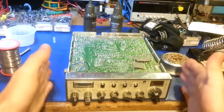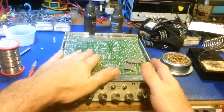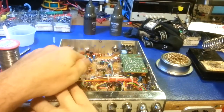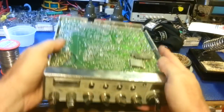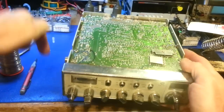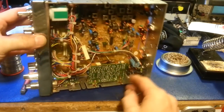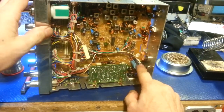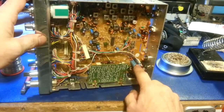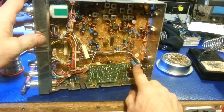The way most mobile radios are mounted is solder side up, components down. Every time the vehicle hits a bump, the radio jerks and the parts are trying to rip themselves out of the circuit board. That's why big heavy things like capacitors get that goopy glue — unfortunately it's corrosive and becomes conductive, but that's why they glue a lot of the heavy parts.